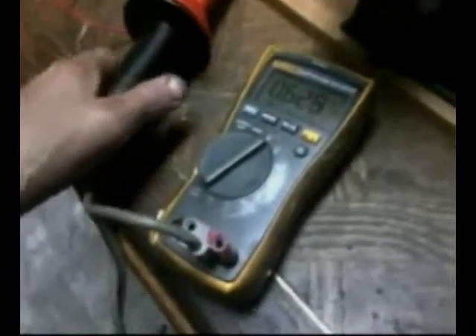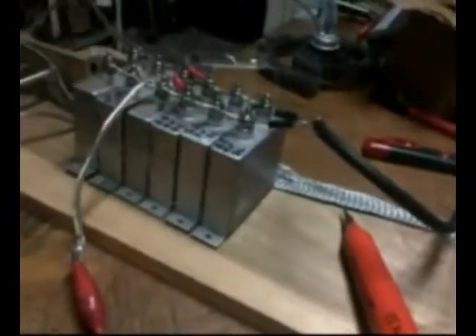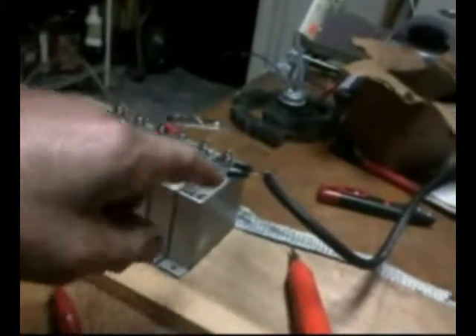700 volts, 600 in this area — it'll jump around. I believe these are two kV diodes, quarter amp perhaps. This is the ground side, that is the hot side. The diodes are on the diagram — the one's the hot. You just need the two in the single wire here. Each one of these coils, I'm only tapping one winding — you've got an in and out while I'm tapping one wire off of each one. The other one is free, in the air.